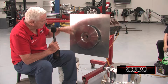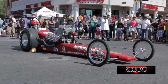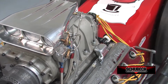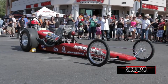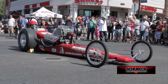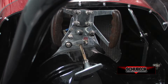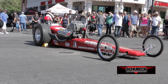The left button activates the clockwise starter that fires the engine, using only the primer fuel. The vacuum in the injector hat continues to pull alcohol through that same priming line right through the stopped electric pump. This alcohol flow continues running the engine until its passage is closed, simultaneously when the nitro valve is pushed to open. This action then runs the engine on nitro only.